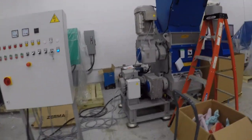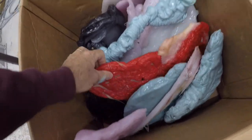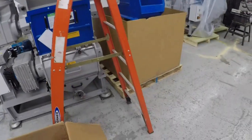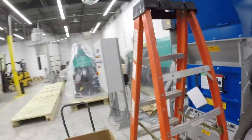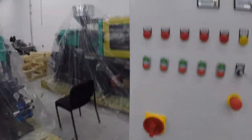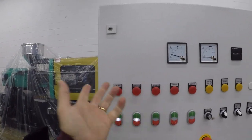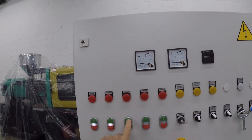Alright, we're going to start your test. Here are the pieces you sent to us — pretty good variety. We're just going to start running the pieces and have them come into a bin right here, then we'll send the material back to you. To start the unit, just turn on the blower — the blower starts up — then the granulator. You can see it comes up to about seven to eight running amps.